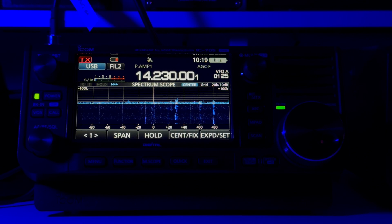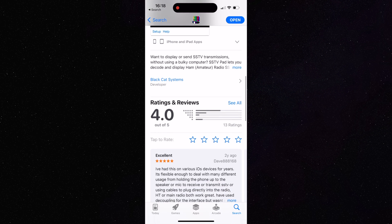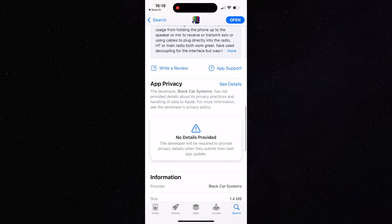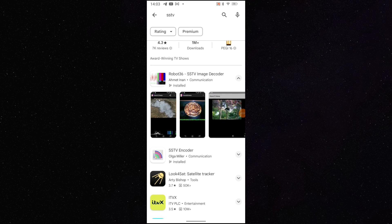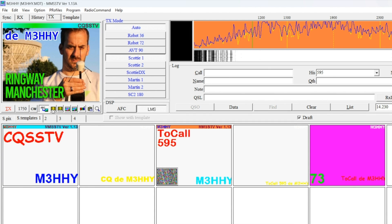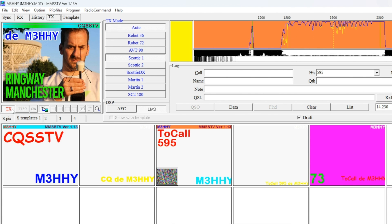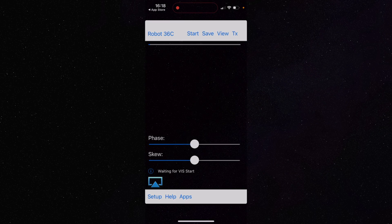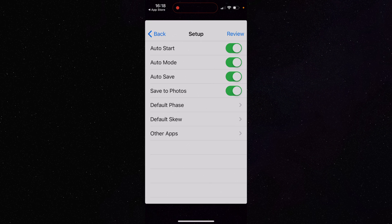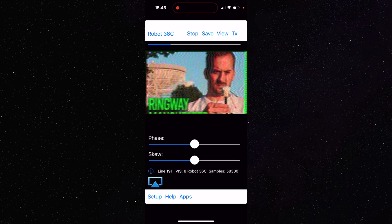So what do we need to receive these pictures? It's simple — a smartphone or computer and a radio. On my iPhone I have an app called CQ-SSTV by Black Cat Systems which you can get on the App Store. There are also SSTV apps on the Android Play Store too and they work quite well. There's also a Windows program called MMSSTV which is free, simple to use, and there's a great tutorial on Hayden's YouTube channel HRDX which I'll link below. The iPhone app is really simple and easy to use — you can select your mode and I just keep mine on auto as the header at the start of the transmission sends out the mode it's using.